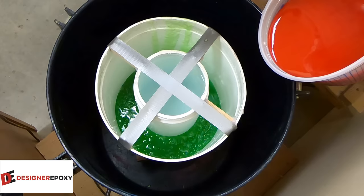And speaking of tools, I've been getting a lot of emails and comments in regards to what tools you should buy to be a wood turner. If you were just going to do bowls with no resin or anything like that, then really all you need is probably a 5/8 bowl gouge and a parting tool. That's essentially what I used for many years. I didn't really use many other tools. Don't get caught up in buying sets of tools, because I personally bought 2 sets of tools and maybe used 1 or 2 tools within that set. So I would recommend buying tools as you need them and staying away from sets, because it can be quite pricey. You can buy cheaper tools that don't cost so much if you wanted to try working on them. But I'd just buy the tools as you need them, because a lot of times you buy these sets, you're just not going to use all of the tools in the set.